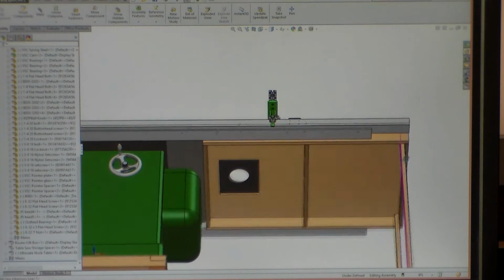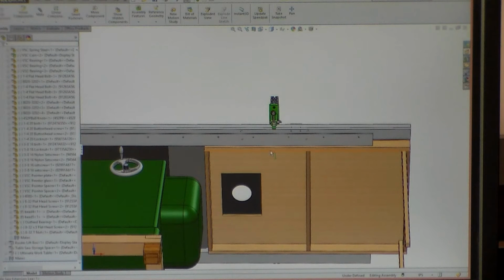I'm going to reuse these legs. But when I built my table before, I think I had probably 3 ribs in here at least, which is too many, and that kind of caused problems for me too. I couldn't really do some things that I wanted to do. So I'm going to build my skeleton out of poplar, with stub tenons in here, like you saw Alan do on his video when he built Jerome Little's extension table. I'm going to use that same design, and so I'm going to have my extension table all set to go.